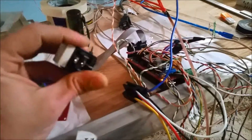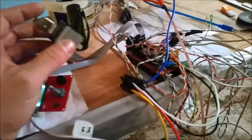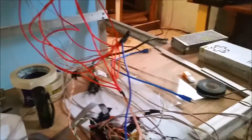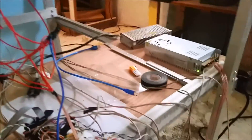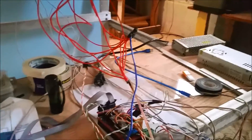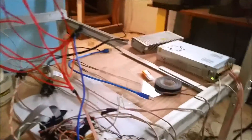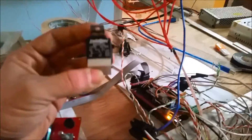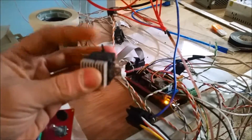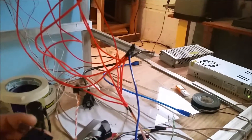It just uses up a lot more current than I anticipated. We had it running through this relay here, which I've got unplugged right now because I'm printing PLA on a cold table and I haven't gone through and fixed these wires yet. Our solution is: first, get bigger wires — that's not even a question. Then we need to get a better power supply. That little 30-amp is just not enough to get these beds up to where they need to be. We're looking at ordering an 80-amp power supply, and we need a new relay. This relay was rated up to 30 to 40 amps, so I figured it'd be good enough, and it was, but it would get really hot. Hence why I put a heat sink on it, which made a difference, but it still didn't make a difference when it came to the wiring.